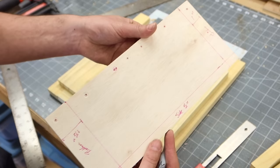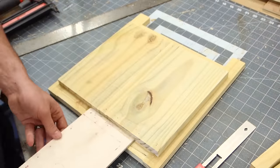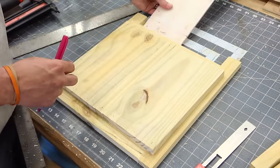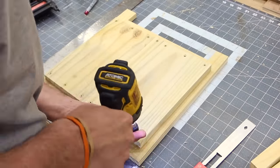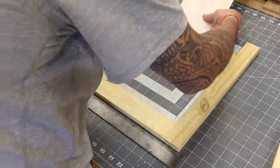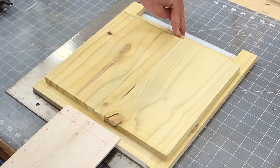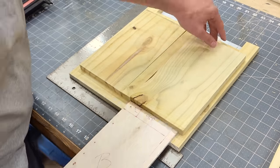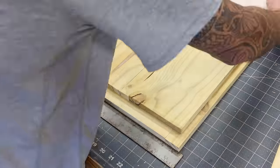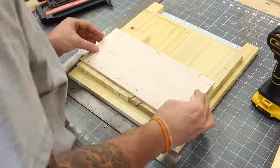After drilling out the marks with the same settings as panel A, once you're done with one end just flip it directly over and repeat for the opposite end. I'm copying the leg inset onto my jig and labeling that side. On one end I'll copy the inch and a half spacing from the leg to the crossboard and label it 'bottom,' and since spacing from the top is one inch, I get that on the jig and label it 'top.' I'll freeze frame the completed jig B in case you want to screenshot it. Jigs make everything easier.